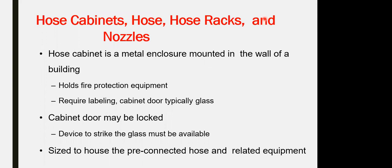By the way, let us talk about the test, the test for all of the components. As a civil defense requirement, all of these components should be pre-approved by the civil defense before you go for any installation. So for any system, the life safety and firefighting system, all of the components you have to submit for civil defense approval. You cannot install unless you have certificates from the civil defense for the manufacturer, the model, and the country of origin for each type.